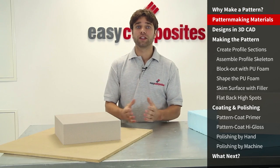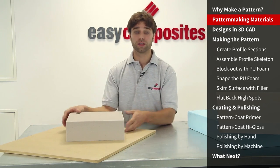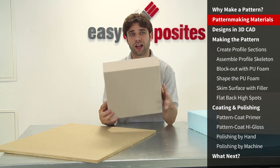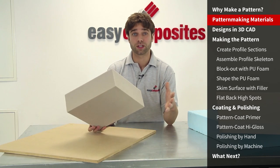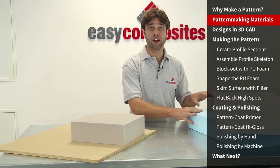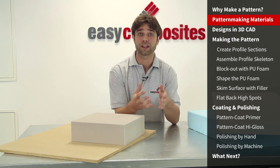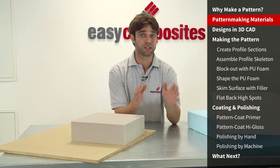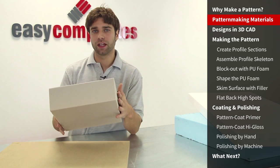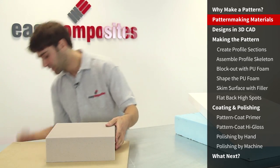Patterns can be made of a wide range of materials but by far the most common are MDF and polyurethane foam. In this tutorial we're going to be using a low density polyurethane foam, which is quite similar to the type of shapeable foam used for dried flower arranging. Expanded polystyrene foam, like insulation foam or styrofoam, are not suitable for a variety of reasons — the most obvious being that body fillers and pattern coating resins will dissolve polystyrene foam. Polyurethane foam, on the other hand, is intended specifically for pattern making. Not only is it unaffected by solvents, resins and fillers, but it's also incredibly easy to sand.